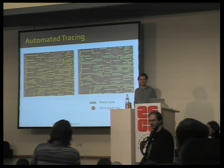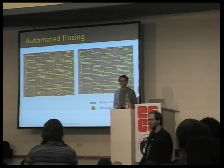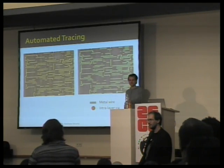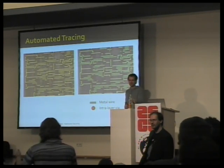Just a quick question. When you've done all this reverse engineering, you will have the working description of the chip in machine-readable form. Have you considered trying to simulate the chip based on this information to judge whether or not it behaves like your real chip does? Yes. In fact, my answer just a minute ago, that we could automatically reverse engineer the different logic cells, would require simulation of each logic cell. So we can simulate parts of it or even the entire chip, but it gets extremely slow. Simulating hardware in software is not efficient, and we have so far only reverse engineered cryptography, where it was very clear when we found the right function, and we didn't actually have to simulate it.